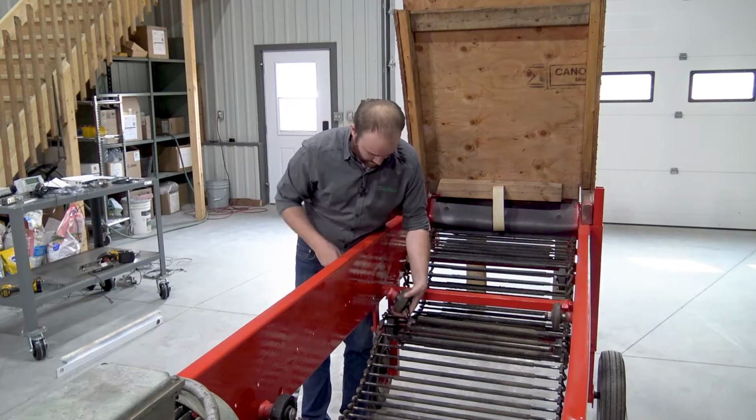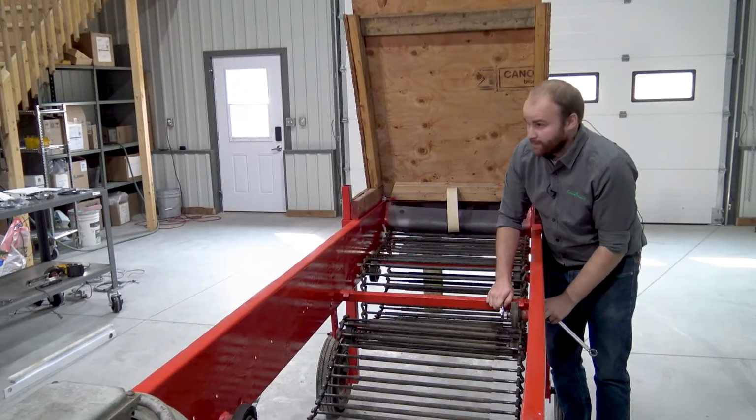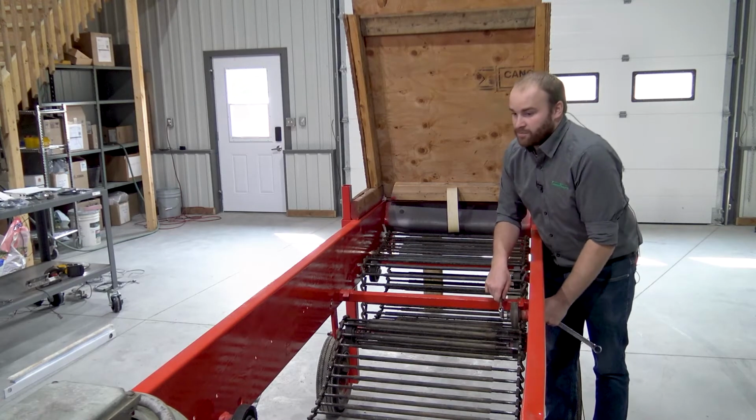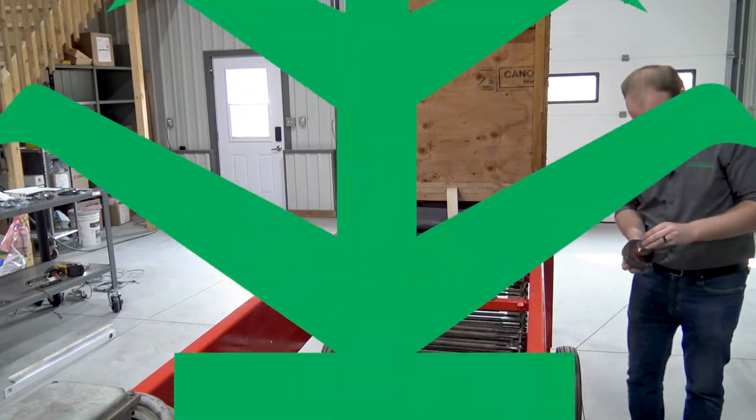In such cases, it is necessary to add a location so that rollers mounted to the load cells end up opposite each other. Rollers before and after the load cell rollers should also be moved opposite each other.